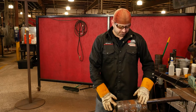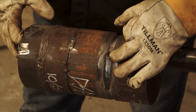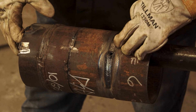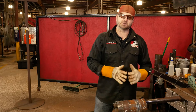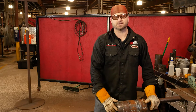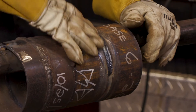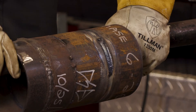What we're going to do is I'm going to take my grinder and grind this part down right here. I'm going to clean this up, get all the 7018 out of the way. I'm going to come over on this side of the TIG, make a nice little boat ramp in there, clean all this stuff up real good with the grinder, and then we'll come back and actually put our TIG process back in. So follow along, watch what I do here — I'll grind it all and we'll talk about it in a minute.